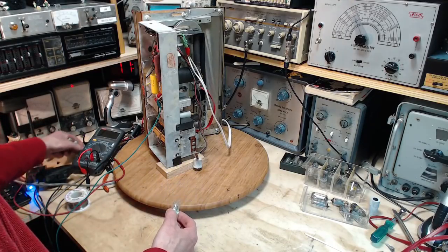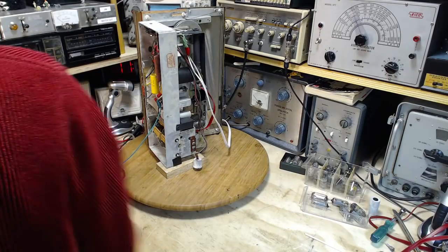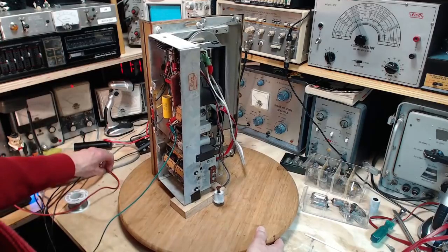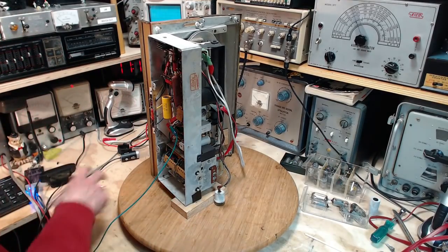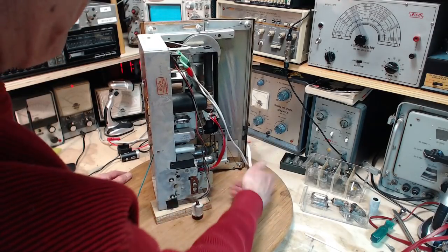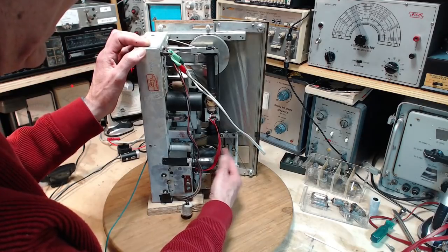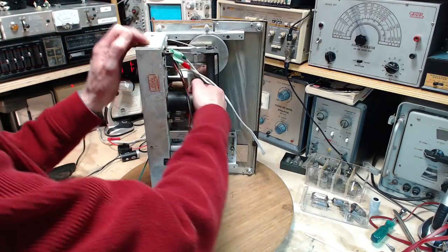A good tube. All these are bad. Bad over here. Good right there. Still got my signal tracer on over here for no good reason. Another dud. Pull all the tubes out. Measure the exact resistance that's there. Well, I'm going to pull these two out because I can't get at the heaters up here. But the one I'm really worried about is the 3V4. Let's do that. 3V4, it's already out.